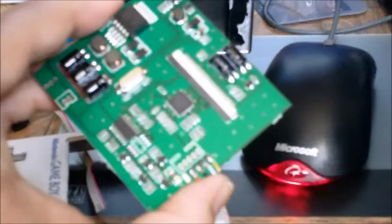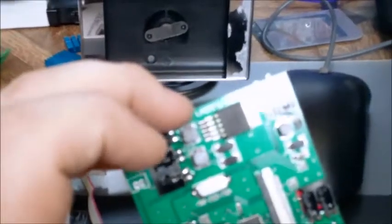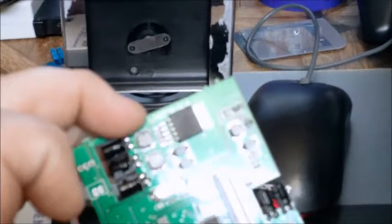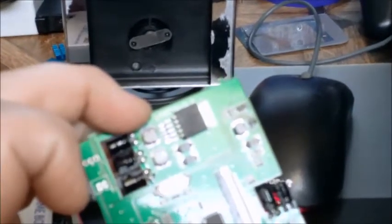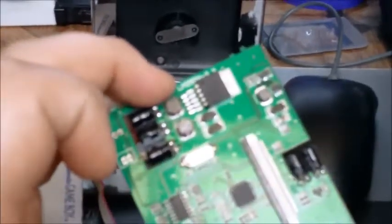The control board for it is actually very nice and thin. There are no real problems with it and there are no controls or anything, so I hope it outputs a picture I like from the start. The inputs are video one, video two, and then it's supposed to be for 12 volts, but up here it's got an LM regulator that says 3.3. I don't know if that's for the LCD as well as the LED backlight.